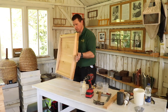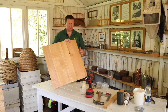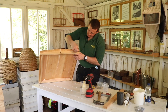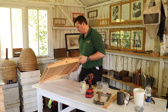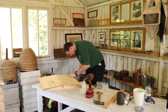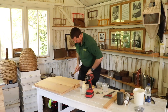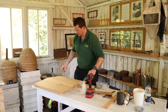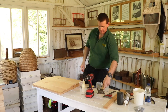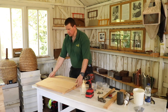And that is the roof complete with the boards on. The next stage is to nail down here. Where you nailed the sides into the gable, just follow that line up and that will give you the position for your centre line so you can nail all the way across there. Again, inch nails. That's that side done — exactly the same on the other side and that's it. That's the basic roof construction finished. Now the next stage is to get the tin on.